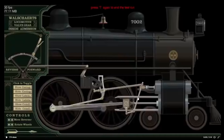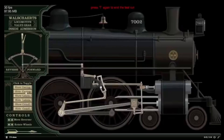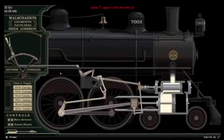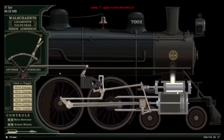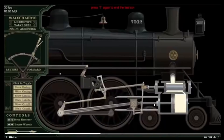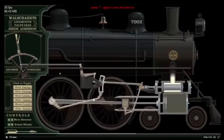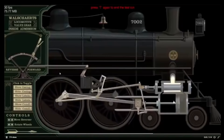The animation shows how this works in motion. Running forwards, the Johnson bar's all the way forward, the radius rod's down, and you can see the radius rod moves with the eccentric rod — same direction, same time. When you center up the Johnson bar, there's no motion. You can see what side the steam is admitted to based on the valve position, and the power stroke pushing the piston. As you bring the bar closer to center, it limits valve travel but keeps motion, admitting steam to the same side for less time — useful for high-speed applications. In reverse, the radius rod moves opposite to the eccentric rod.